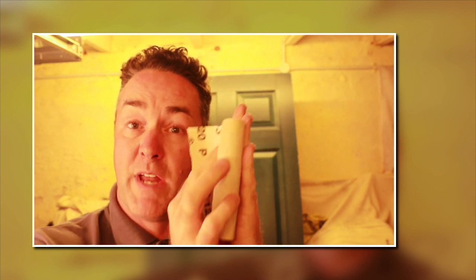For the 120, it's a bit long so I fold it over to about five or six inches, crease it the opposite way to get a better crease, then rip it off neatly. Fold it over again and you've got two sides to use. If you want to be really professional, buy a rubbing block — made of cork, wood, or rubber — and wrap the sandpaper around it for a flat sanding surface.